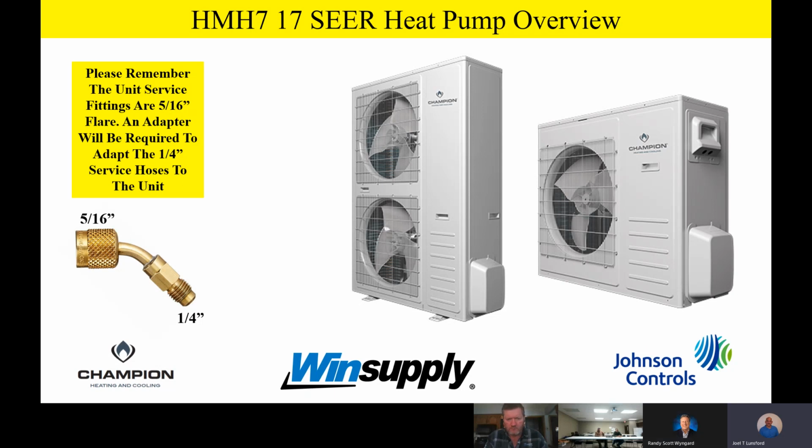But one thing I would like to remind everybody is please remember the unit service fittings are 5/16, very much like a mini split. And you're going to have an adapter that's going to go from 5/16 flare down to 1/4 inch flare for the service hoses. A lot of your contractors that already do mini splits, this is going to look real familiar to them because this fitting is similar. It's the same type of service fitting for a mini split, and they probably have these adapters on their truck. But if not, there's a lot of different companies that make them, Robinair, Yellow Jacket, and so on. You guys probably have some in your showroom right now that go from 5/16 female down to 1/4 inch male for the service hoses. So you will need that adapter to get your service hoses onto your gauges.